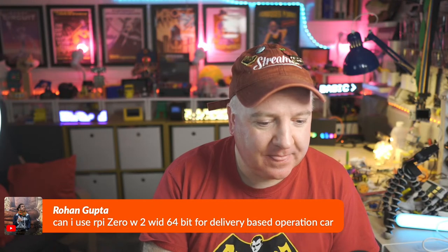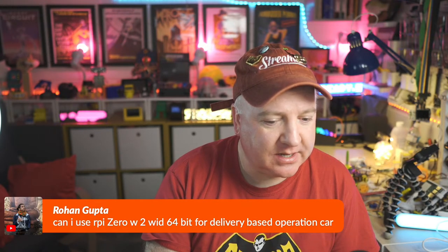Let me just have a see what else we've got in the chat. Rowan says, can I use a Raspberry Pi Zero W2 with 64-bit for a delivery-based operation car? So you can use a 64-bit OS on a Raspberry Pi Zero 2, that is. The problem with Raspberry Pi Zeros is they only have half a gig of RAM, and you'll run out of that pretty quickly. It depends what you're doing with that delivery-based operation car. If you're running something that's well within that space, then it'll work fine. If you're running something that needs virtual memory or more than half a gig of RAM, then you'll probably need to look at a Raspberry Pi 4 or something like that instead. That'd be my guess. It depends on how much memory is being used.